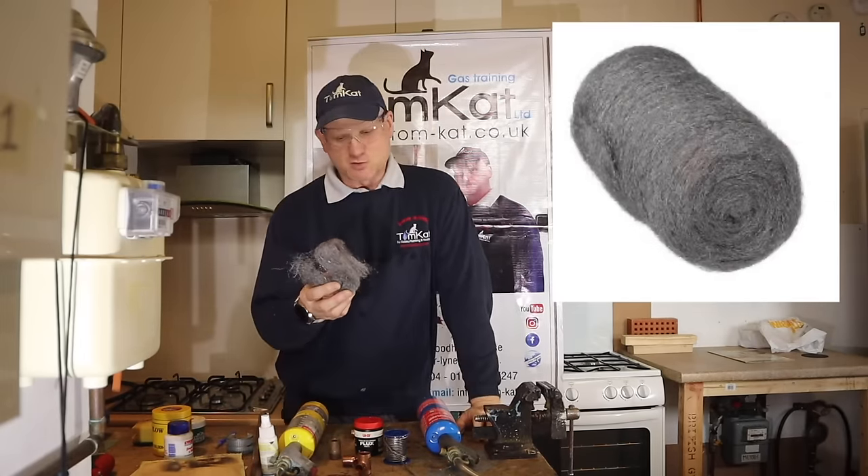You don't need that much solder. With a nice flame — remembering this is a big torch — I'm going to place the heat onto the bottom fitting and you'll see the flux run around. I just dab the solder until it starts to run. And that's it — the solder has gone all the way around. That's called capillary attraction: when you've got two metals together, you apply heat, it creates suction, and that's how the solder is drawn into the fitting.